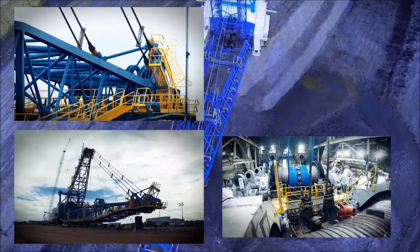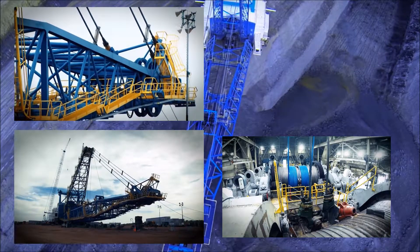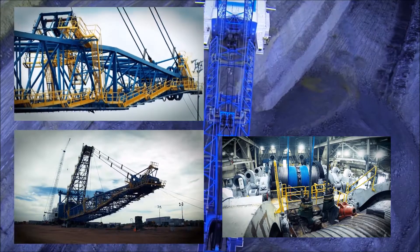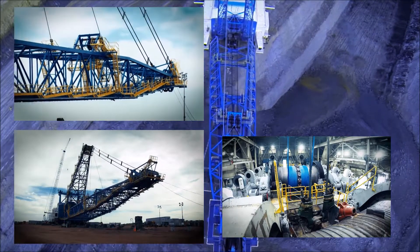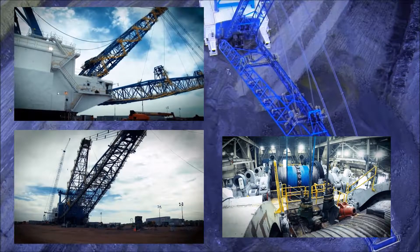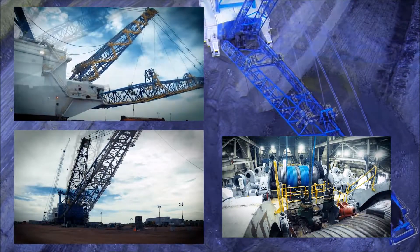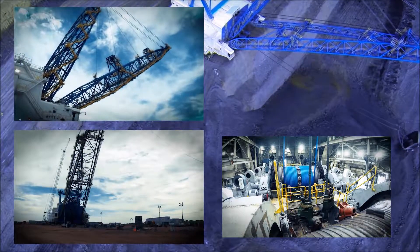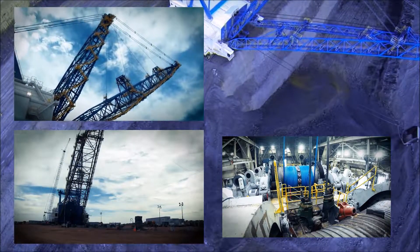The main thing we watch is the drum with the hoist ropes and the sockets that are fixed to the machine that are holding the boom and mast in the air — those are our priorities, to make sure that they don't slip. That's an automatic hold, so we're looking for major things that could cause damage to the machine. If there's no damage to the machine, we're going to continue to go up until we're pinned.